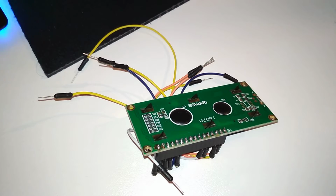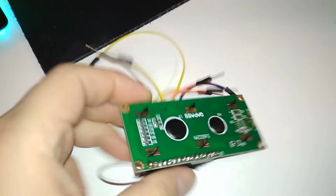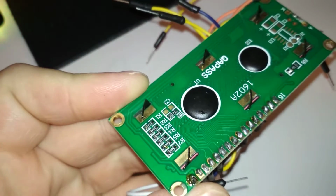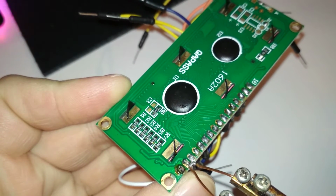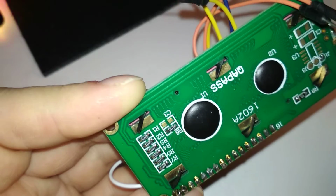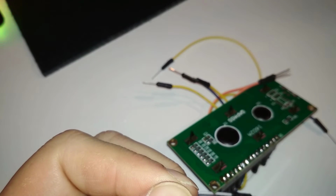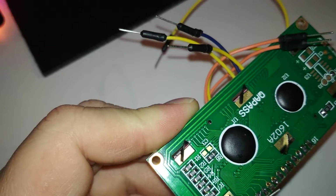Let's go, Brandon, all the way. So I put some more solder on the tip of the iron, and yeah, let's try this. Okay, maybe a whisker is between the two. I'll have to check after I solder every one of them. So just a little less solder will do. I've been putting too much on the tip because this already has plenty on the pin.